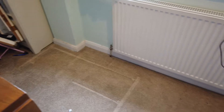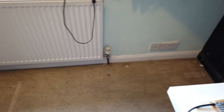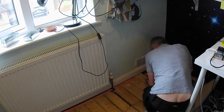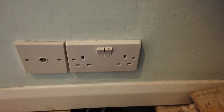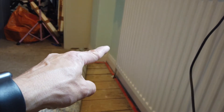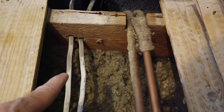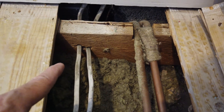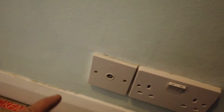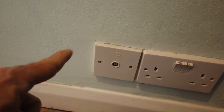We've now pulled the desk back and everything else that was in the way. We are going to pull the carpet back and have a look at what's underneath. We've lifted the floor and our cables run back underneath us. We want to put a new socket on the wall over here, so what we are going to do is split the ring here, join it in a maintenance free Wago box under the floor, run it back to there, come back out, and run it to here where we'll have a new socket on the wall.